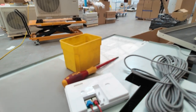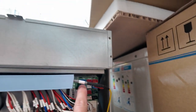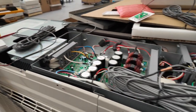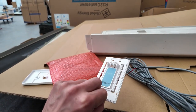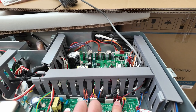This section is an exploded view of all the low voltage connections in one place. The touchscreen has two connections: the main one that connects to the CN22 connector, and the second connection which is the Ecolink connector that connects into the Ecolink power hub. You also have your tank sensor which goes into the tank itself and connects into the yellow plug connector, and your room sensor which connects into the white connection. That covers all of your low voltage connections into the heat pump.